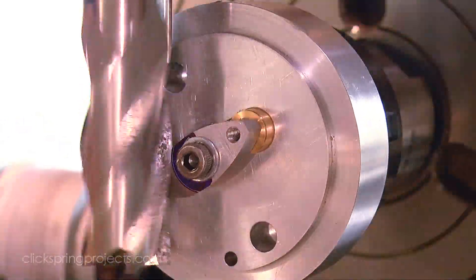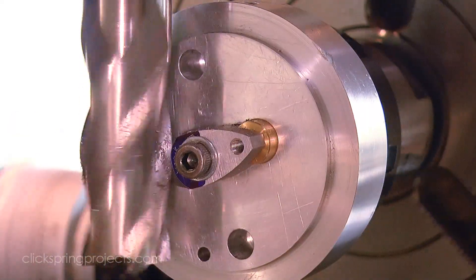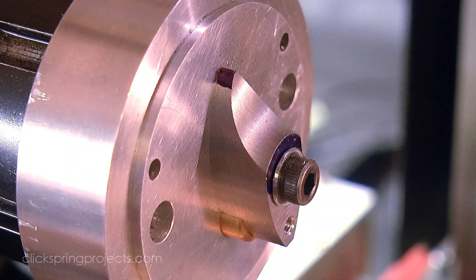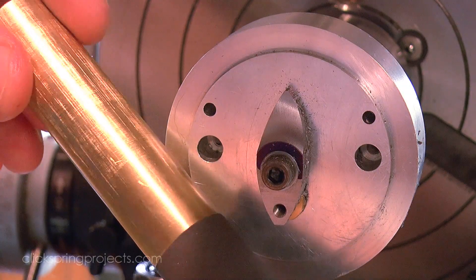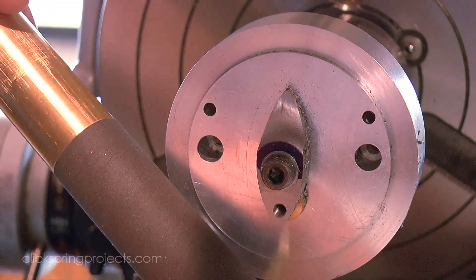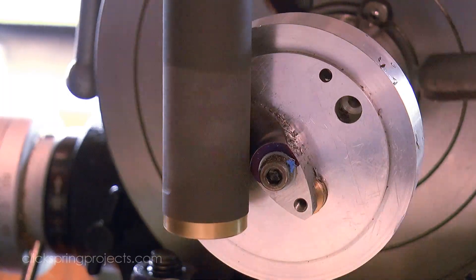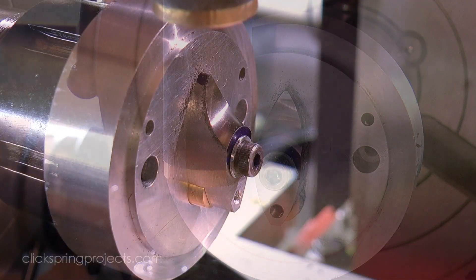And I say just short, because there's an opportunity to make this surface a standout feature of the tool. Again, it would be quite ok to leave the tool marks as is. But by leaving on a small allowance, they can be taken out with abrasive paper. In this case I've bonded a piece of 600 grit abrasive paper onto a length of brass stock of the same diameter as the cutting tool. A couple of passes brings the part to final dimension. It leaves behind a bright textured grain that contrasts well with the other grained surfaces on the part, and catches the light in an interesting way.